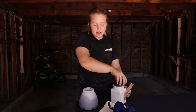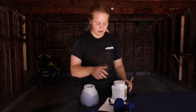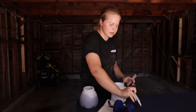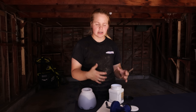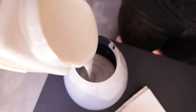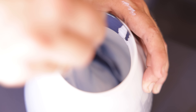I'm ready to go ahead and spray the top coat so that can dry while I finish sanding the doors. When I'm spraying, I like to leave the extra paint in the sprayer and pour the top coat right in — the extra paint helps tint the top coat. When using a darker color, I like to tint it to eliminate any cloudiness, so it's basically like spraying the same color as a top coat.